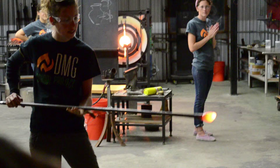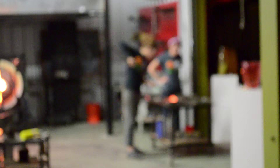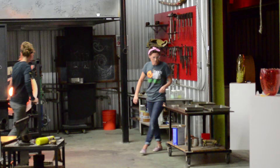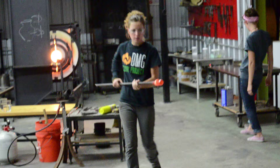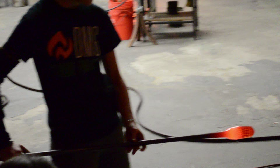Glass is very hot and liquidy when it first comes out of the furnace — it stops turning and just drips right off the ends, so you're always turning. Once it cools down a little bit, you can go back in and get more glass. We've got our color pattern in here; that's what all the pooling in the mold did — broke up the color and the lines. We have a small bubble inside, so we'll let it cool down a little and then get some clear glass over the top.